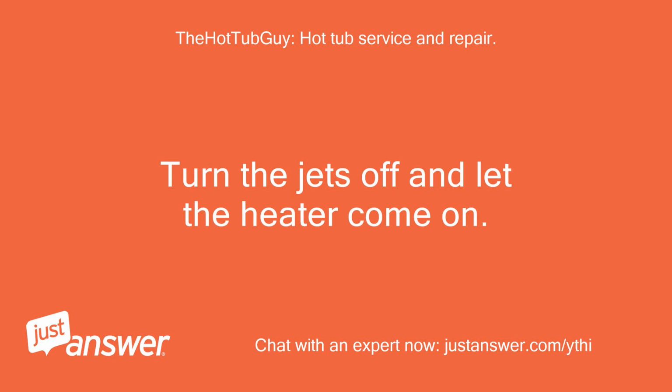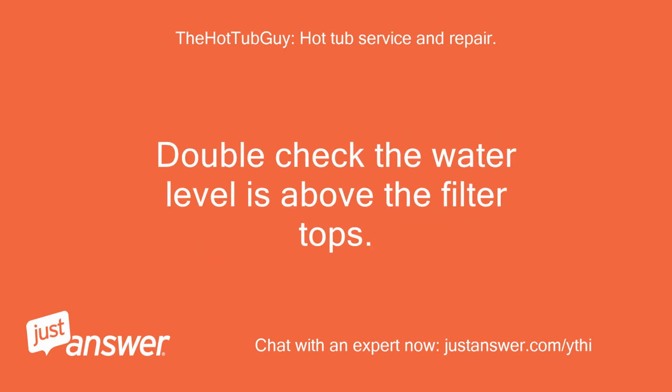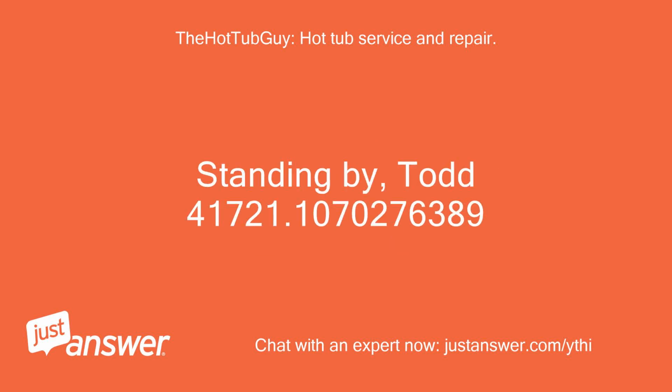Turn the jets off and let the heater come on. The flashing power light means the high limit tripped because the heater got too hot from no flow. Double check the water level is above the filter tops. It wouldn't hurt to remove them for this step temporarily. Standing by, Todd.